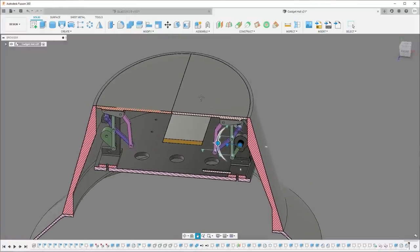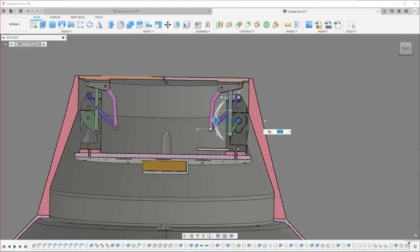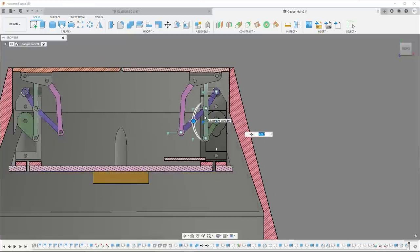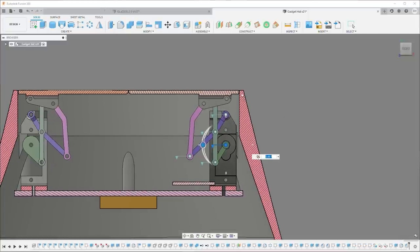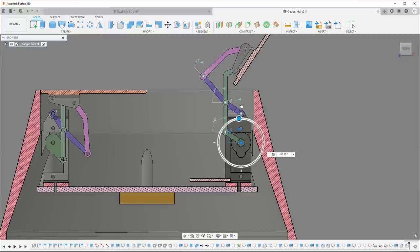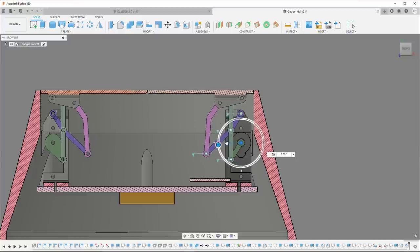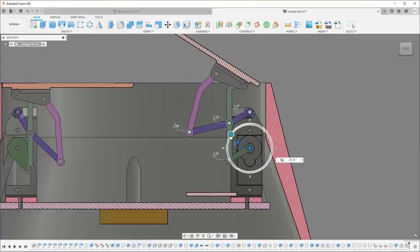Looking at the 3D model, I've split the top of the hat into two independent pieces that open up along a seam. Each flap is opened by one of the micro servos, and this hinge mechanism is a 180 degree flush hinge. I found the model online, scaled it down for my purposes, and adapted it for the servo with mounting points. I really wanted the top of the hat to sit flush with the side so it looked fairly normal, even up close. When I grab it, it opens up — so satisfying!